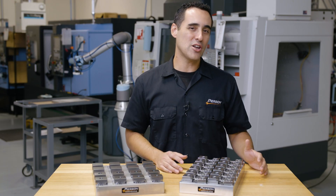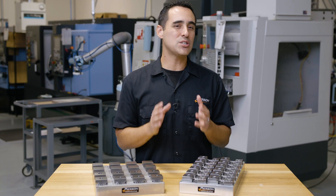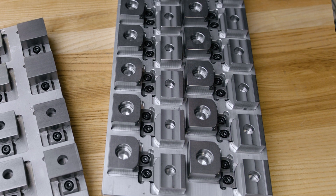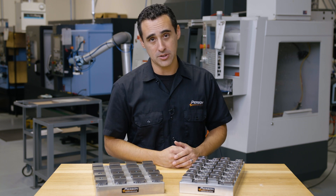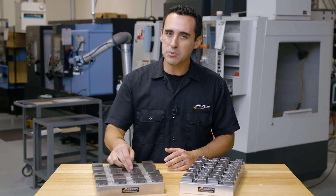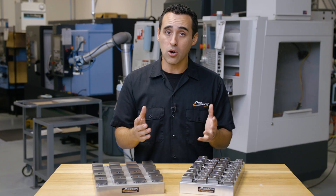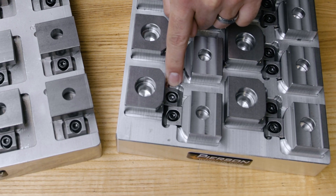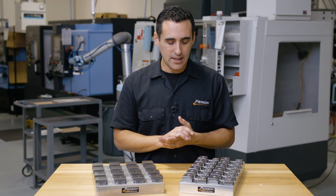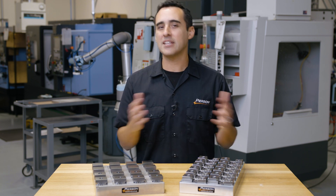The second thing to notice is how we used one pocket for two clamps. This was key to increasing part density. This staggered layout is a little more tricky to design, but well worth the higher production numbers. My machinist Alex told me that one of the things he didn't like about the old pallet was how chips were constantly getting stuck in the pockets around the clamps. So we left a gap of about ten thousandths on each side of the clamps so chips don't accumulate. It doesn't solve all the problems — a chip might get wedged in that ten-thou gap — but it's fine.